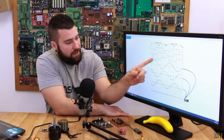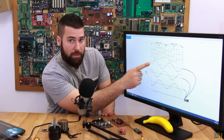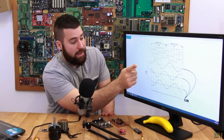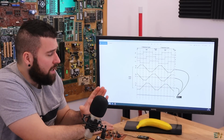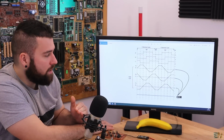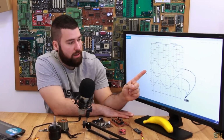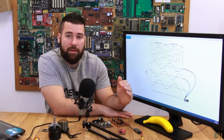Let's just look at the first step. In the first step, on the back EMF, you will see a rising ramp of voltage on the positive side and a falling ramp on the positive side as well. And then you will see a totally negative voltage. To understand better, let's just say that positive is +1, negative is -1, and floating will be 0. So exactly in this step here, a positive rising ramp with a positive falling ramp will make a +1.